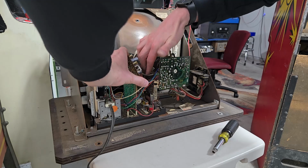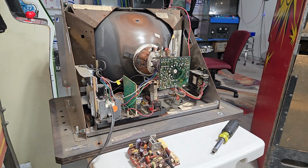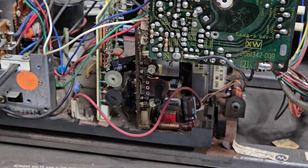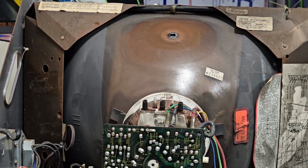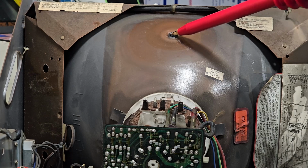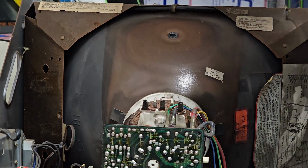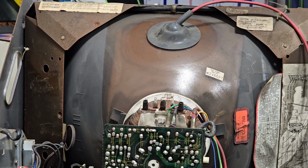So this thing is supposed to have a piece of plastic that holds the cards a separate length from each other. So I'm going to put some electrical tape on that guy there because it's getting awfully close. Should be relatively safe. We're going to put the shocker back on there. Get rid of the extra charge the tube accumulated because it does. These things are great at doing that. Giving you a nice little surprise afterwards. Stick this stupid thing back on there. I think that's it.